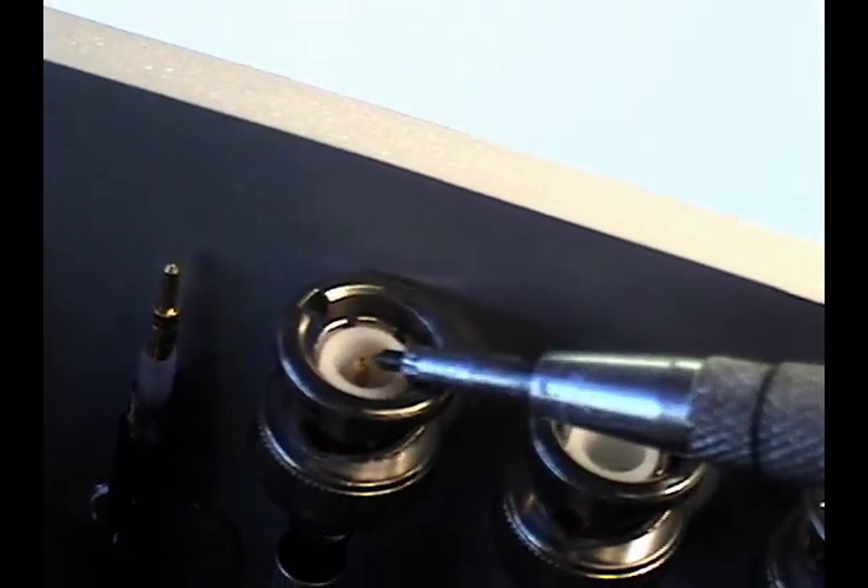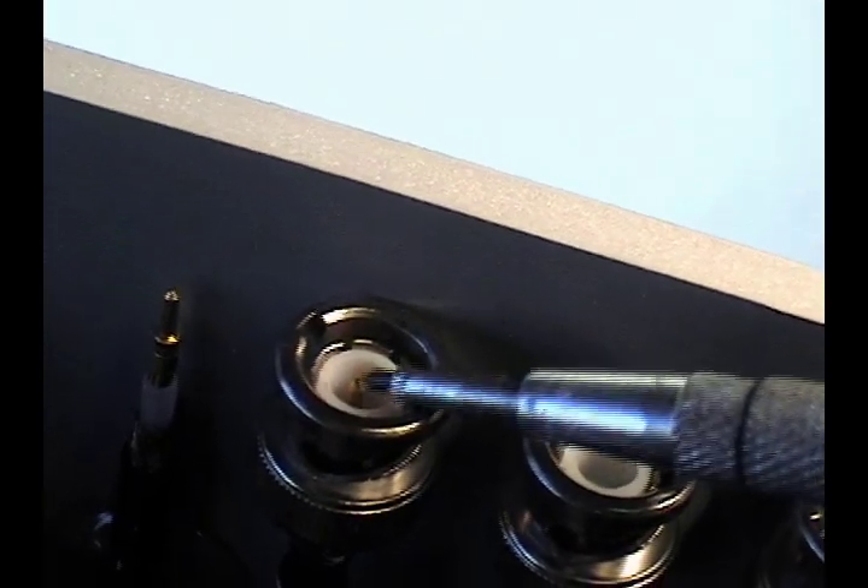The main thing you look for is that the center pin connector depth is approximately flush with the annulus of the connector.